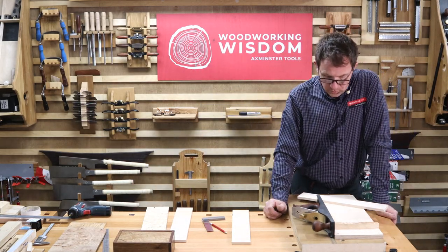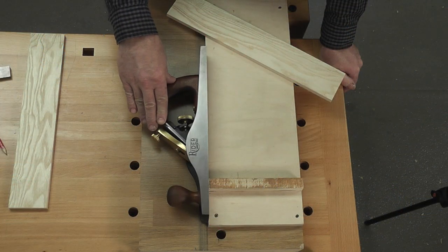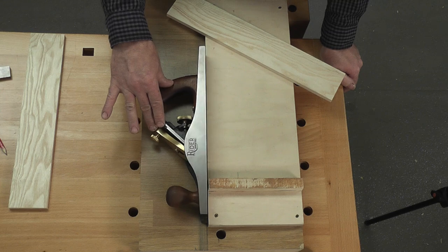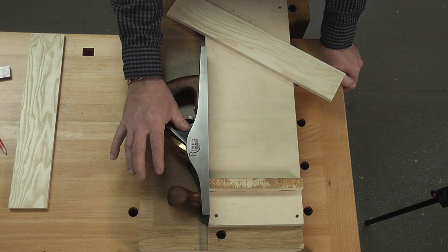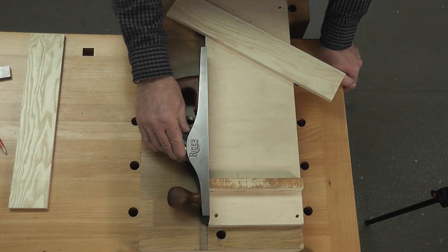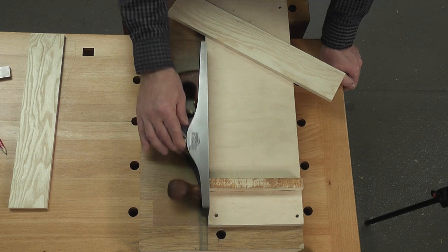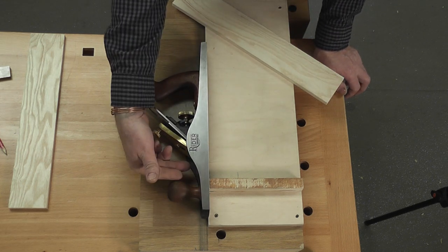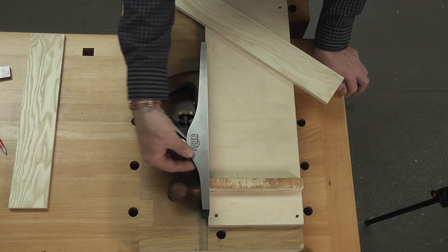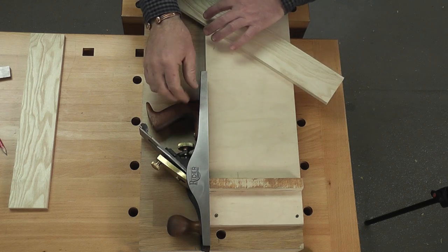Next thing, when you go to hold the plane for this, if you hold too far back from where the blade is, you'll tilt it. Not good. Best place you can grip this, my thumb, if I'm right-handed, I put in there or up on here. Got that way of gripping, just in there. So I'm actually pinching, if you like, almost between the frog. That means I'm not tilting down, I keep it square. The other place you can grip nicely, put your fingers just inside where the mouth is, get to there, put your hand on the top. But you want to keep it nice and square.